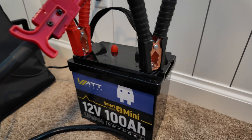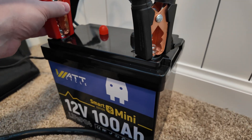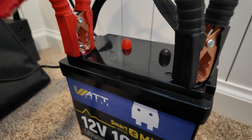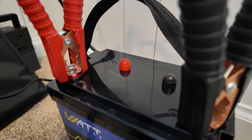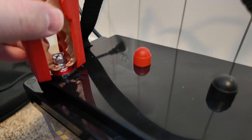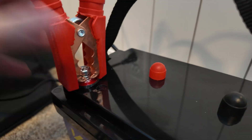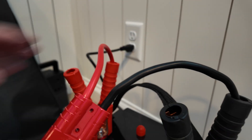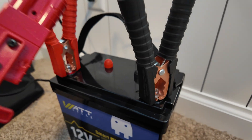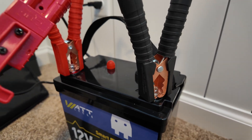Dumping in some good power here. It's only been a few minutes, and I was just going through and feeling — right here where this clamp is clamped on is getting really, really hot, so I don't think we have a very good connection. This negative side is doing well, but the positive side is getting quite hot. The cable's a little bit warm to the touch as well. I want to change these to the ring terminal connection, so we're going to do that quick.